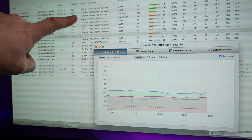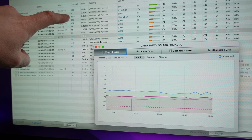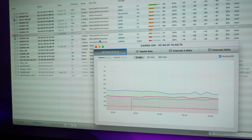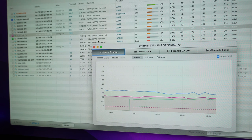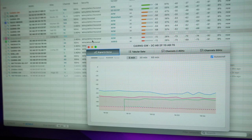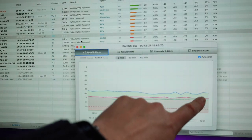I'm using channel 149, but I must point out that in the UK, at least, for outdoor site-to-site use like this, you would need a license to use that frequency — so those channels can't be used in the UK. If you're going to buy one of these, check the regulations in your area to see whether you need a license from the national authority — the equivalent of UK Ofcom — because it's quite likely that for an outdoor Wi-Fi site-to-site access point setup, you will need a license. We can see along the bottom here that we're maintaining a pretty good gap between these two — this is your regular home Wi-Fi versus the benefit of using the bridge.